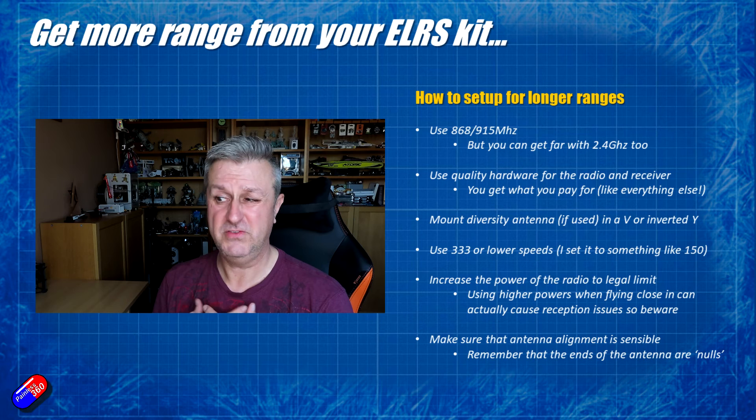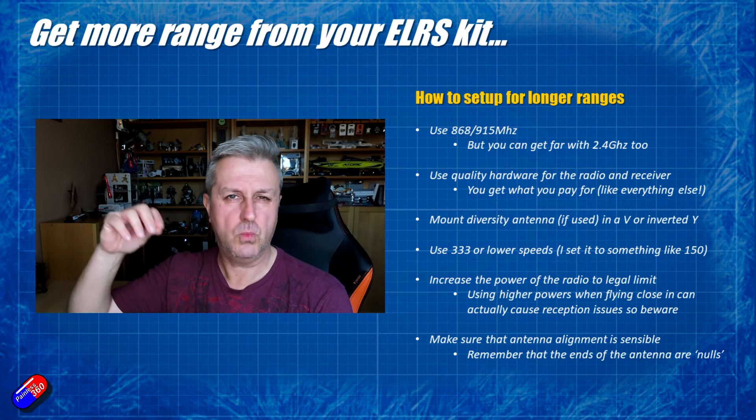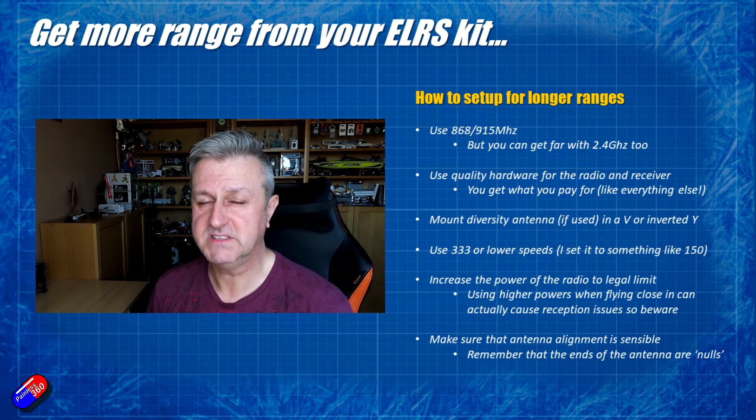all the reviewers went back and said the range is terrible. They replaced it with a little piece of wire rather than that little ceramic thing on the PCB, and it made a massive difference — much, much better with that kind of antenna.